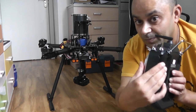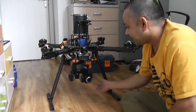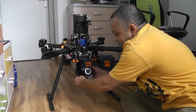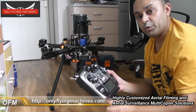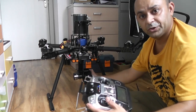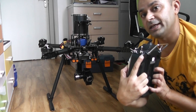1, 2, 3 — now you have to calibrate the gimbal: move it 360 degrees on the pan axis, then on the roll angle and tilt angle. Hold the gimbal steady and put the throttle up a little bit — your gimbal will start working. If you put the throttle down your gimbal goes inactive. So hold it in a steady position, put throttle up slightly, and you can see the camera tilting up and down with the slider.